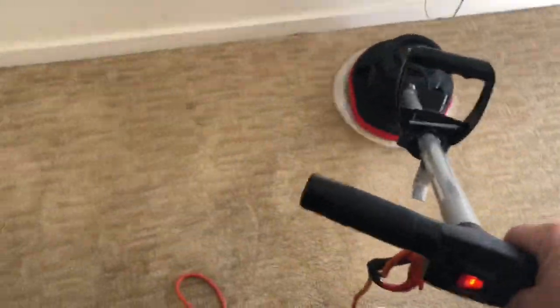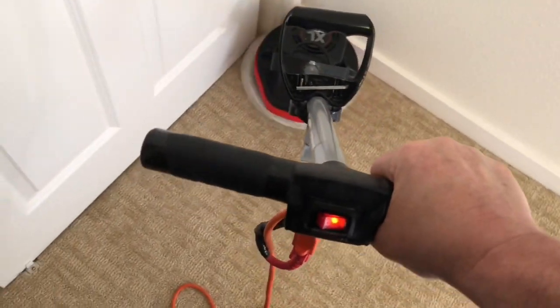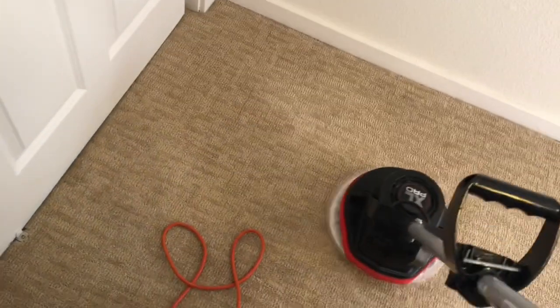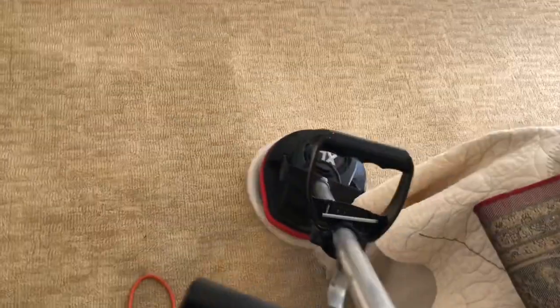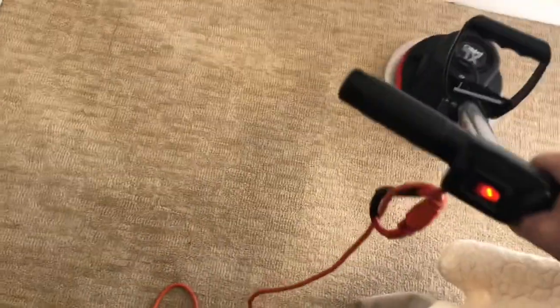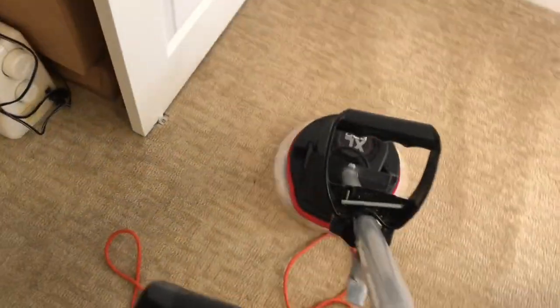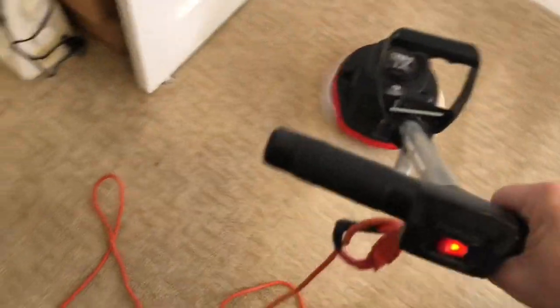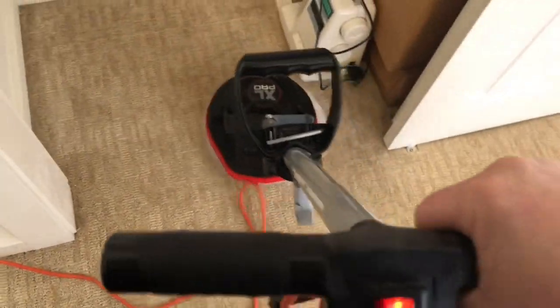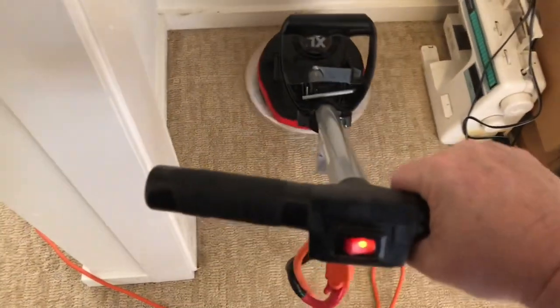And the customer said that they were embarrassed of all the spots and stuff, so they pre-treated it themselves, and that they've always done that in the past with carpet cleaners. This is not a regular tenant of mine. Well, I explained to her that if she pre-treated it, I can't guarantee that she won't have any wick back, because depending on what she used, there could be a lot of residue down below the surface of the carpet that I'm unaware of, and that I would call her in and show her as I went along.